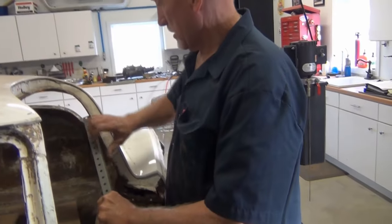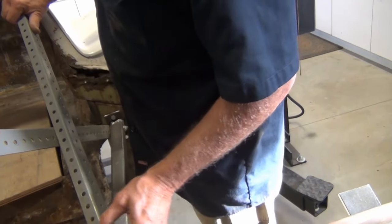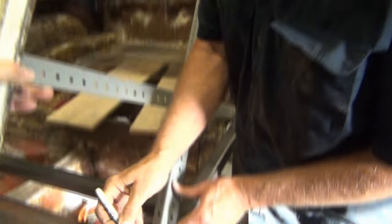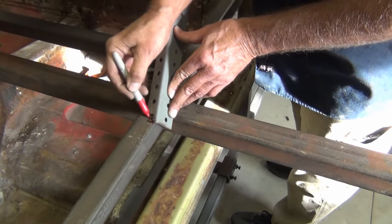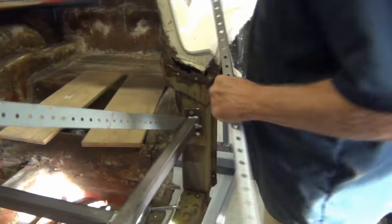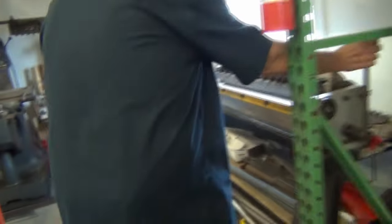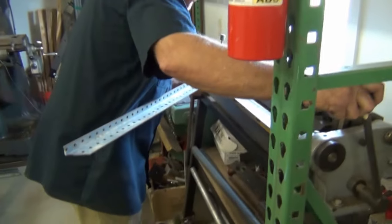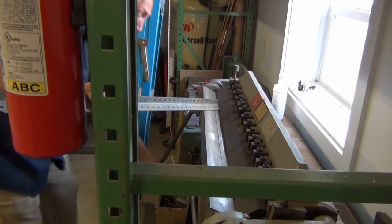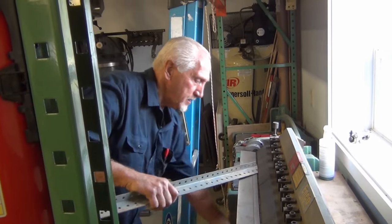So the idea is if we can bend this in, drill our hole, and tack weld this right here where I can get to it. Now what I've got to do is bend this — give me a little bend here. Let's do this one in the press. All you do is stick it in here like this. It's a pretty thick metal for this press, but it's a short piece so it shouldn't be too much pressure on it. Lock it in place, grab one of the handles, watch the metal rack — simple as that.